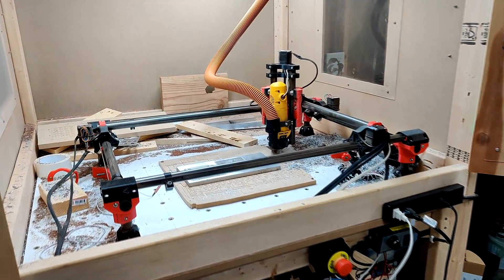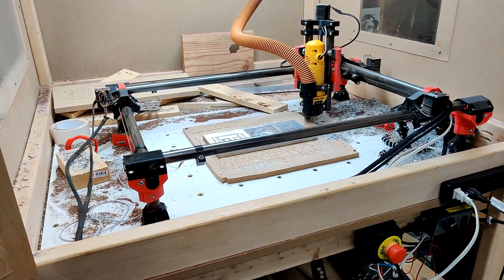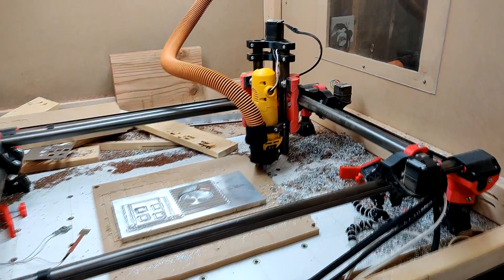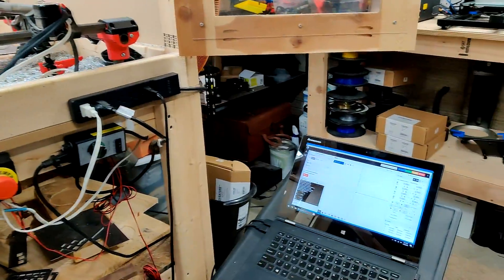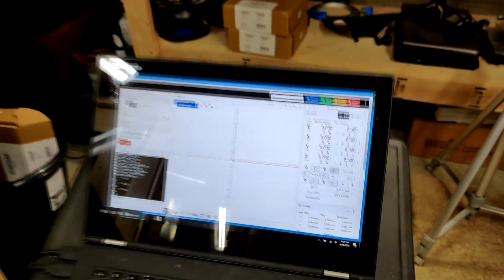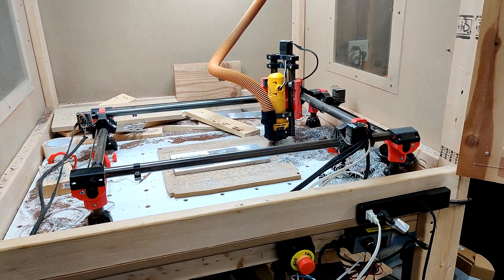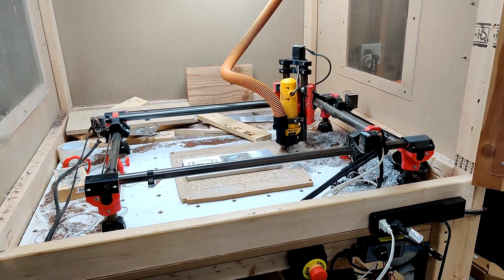That's pretty much going to do it. I haven't had any hiccups with the machine so far. I'm still using the full size Rambo. The belts are staying tight, no real hiccups with motors or anything. The DeWalt router is doing pretty good — I expect a brush change shortly; I've had this for about three years. Still using CNCJS and I'm kind of making shortcut buttons and custom commands as I go. I apologize if this video was kind of boring. If you made it this far, thank you for watching. Feel free to subscribe — I plan to keep this train going. Thanks for watching and we'll see you in the next one.